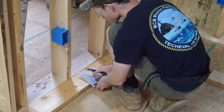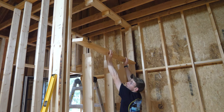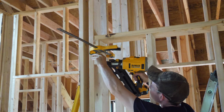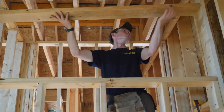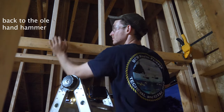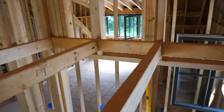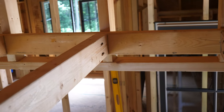Here I'm copying the layout of the studs from the bottom plate. My little two-by-four joists sit on our wall at the other end. I know they make hangers for this, but I used pocket screws because I don't have any of the hangers on hand — and I am so impressed with how strong three pocket screws in the end of a board are.